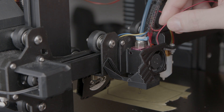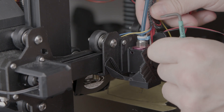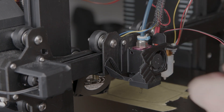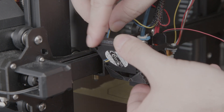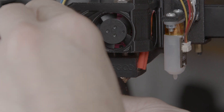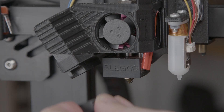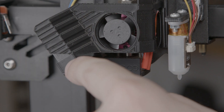These wires can go inside the space that we made, and this whole assembly can also go inside but we need to work it a little bit. The fan goes in like this and we need to run the wires around the side. If we push the fan up a little bit, we can take the guard piece and slide it onto the bottom of the fan — the guard piece should line up right here. Then we push the fan down again. Then we take the tip, which has a stopper inside, so it should go in until the fan hits the stopper and lines up with the shield guard.